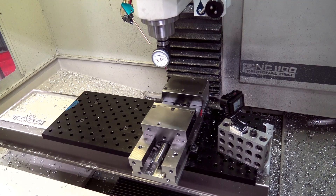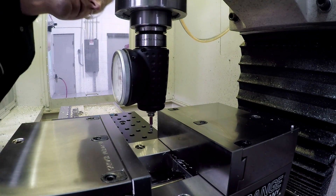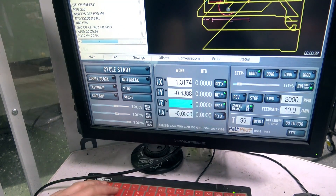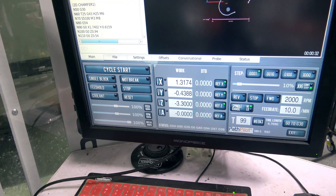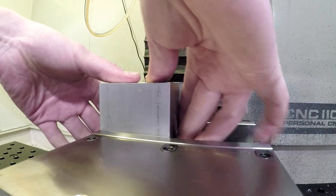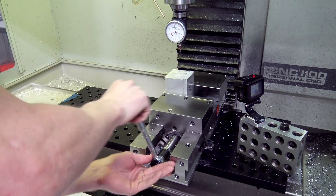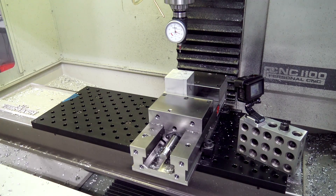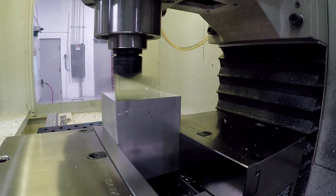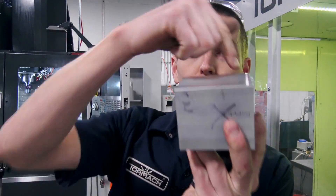Let's face the other side square, perpendicular, and to the 3.3 dimension. I've got my Haimer - going to find the bottom of our jaw frame without crashing it. In PathPilot for tool 99, which is my Haimer, I type negative 3.3 enter, which sets our current height as negative 3.3. Make sure no chips are on the part, slide it in and tighten down. Anybody catch my mistake? I extended the superfly, which was smart - making the whole face in one pass. The wrong thing was forgetting to remeasure. We now have a block that's too short.